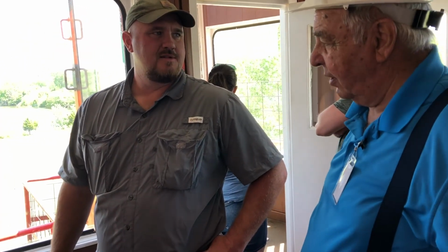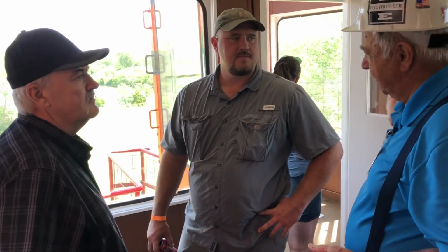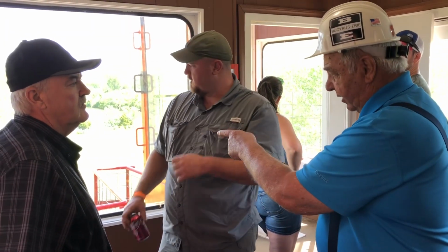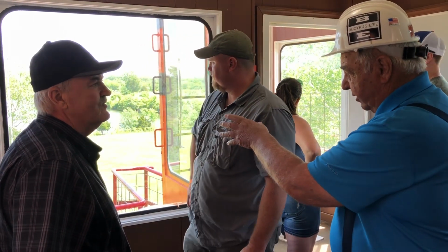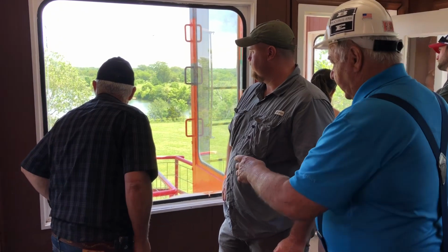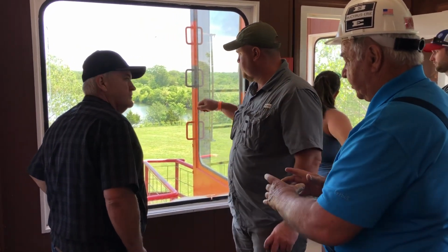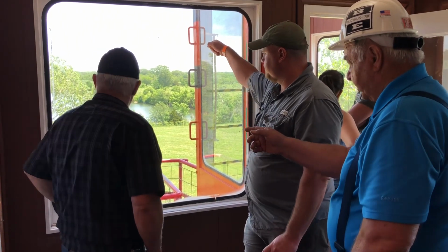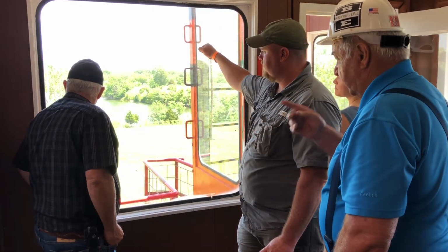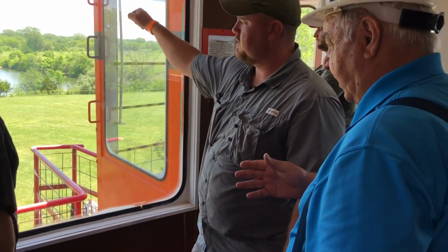But anyway, on board there were 2 60-ton deck winches, with probably 800 feet of cable on. And there's a retractor over there that goes down in that square tube. Actually, see the round tube below it? There's a thread bar that goes down through that tube, and you see that motor on the side? Okay, if you were going to change it, you'd set the bucket down very similar to how it is now.